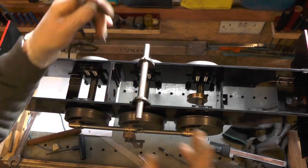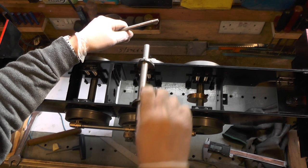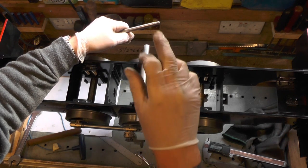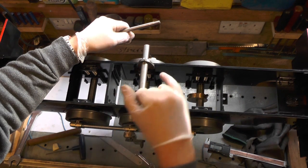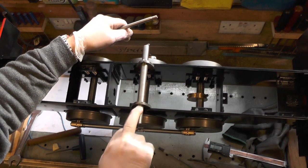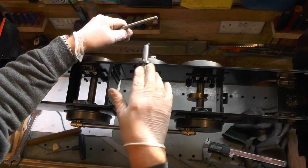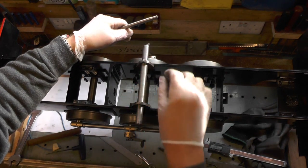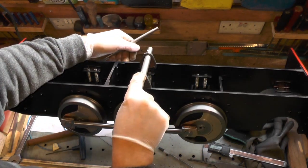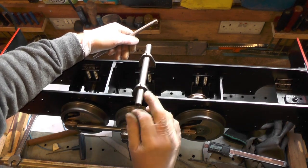Once you've got your tube made and fitted, I'm going to saw these 6BA screws off flush. You can just put hexagon headed bolts in and tighten them down, but I'm avoiding that route. I'm going to Loctite the brackets onto the tube, put my screws in, Loctite them in, and then file them off flush so they don't look unsightly.